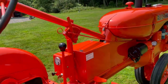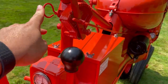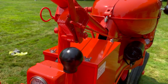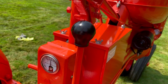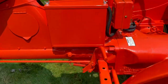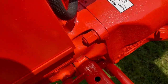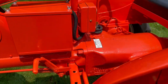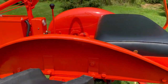Lastly, up on the steering box is a throttle and a choke. Now I already ran this to drive it where it is, but I'll go ahead and start it now. Step one is make sure it's out of gear, and if you're sitting on it, it's a good habit to push down the clutch. Since I'm not sitting on it, this actually has a neat lever that you flip over — now the clutch is pushed in. That's just nice so if for some reason it is in gear, you don't start it in gear, because there are no safeties when it comes to doing that.